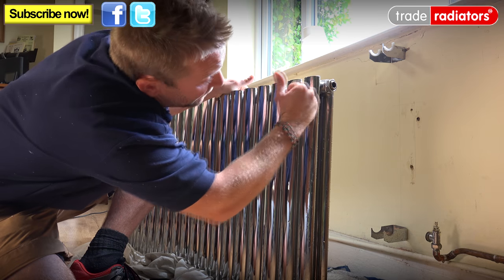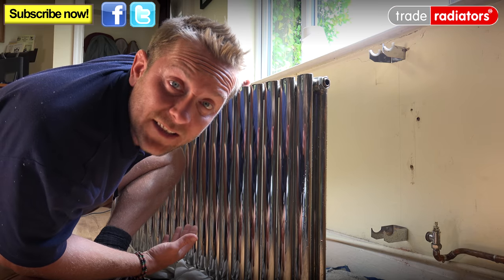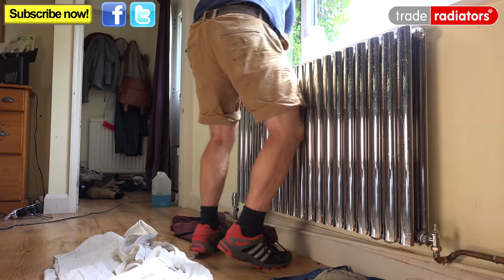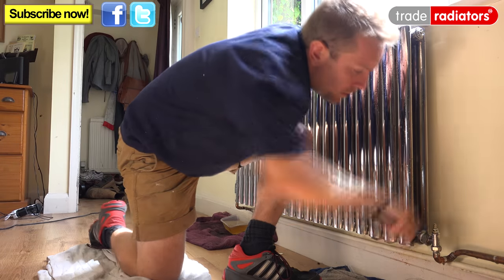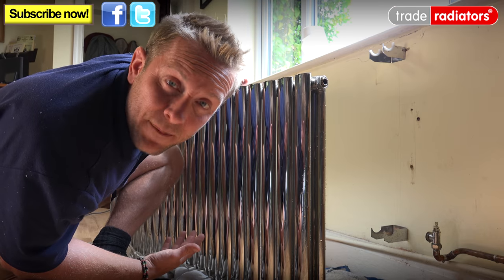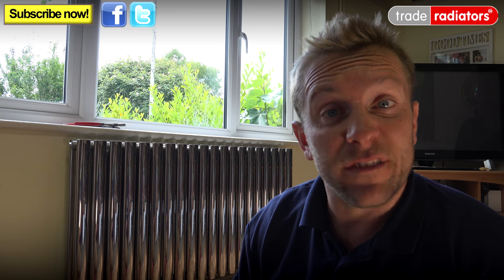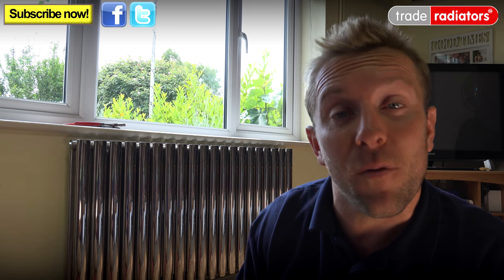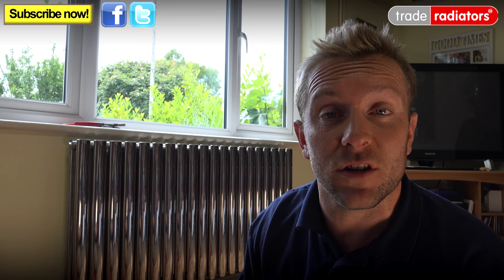So now we've got the radiator filled up to about here with water. Basically do the work that you want to do behind the radiator, and then do what we've just done in reverse order. I recommend that if you haven't done this before, watch this video a few times and then get someone to help you, because it is a quick way of doing it — but if you get it wrong, you could end up with a lot of water on the carpet, or have the radiator fall off the wall. Definitely make sure you know what you're doing and get someone to help you if you don't feel confident. You've seen how easy it is to whip off one of these radiators. I can't reiterate enough the importance of getting all your towels in the right place and making sure you're nicely prepared with some help before carrying out this job.